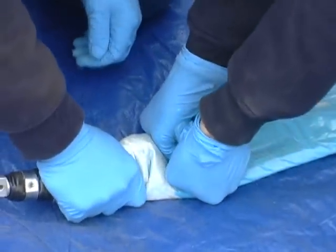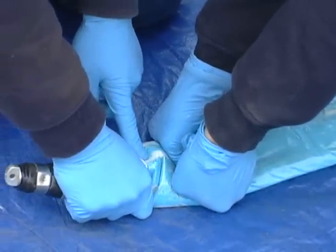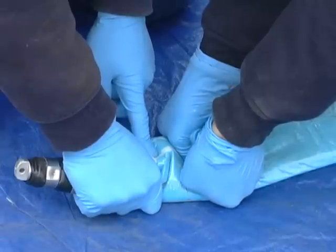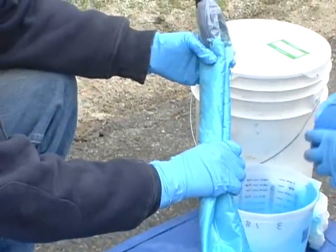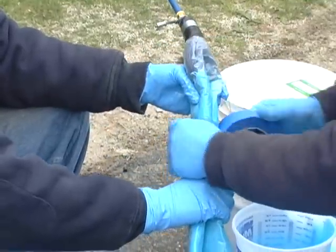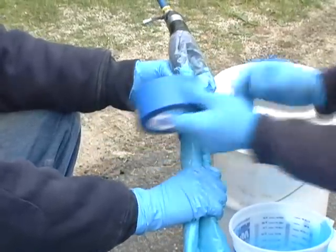the liner is carefully rolled and wrapped with low-tack painter's tape to reduce its profile and allow for easy installation. It is then attached to a metal cable and pushed or pulled into the correct location from the nearest open access point. Depending on the size, type, and location of the job, we also have the option of using a pressurized air cannon to launch the inverted liner directly into the pipe.